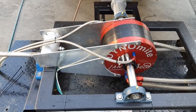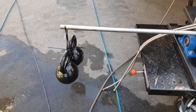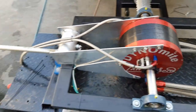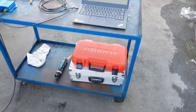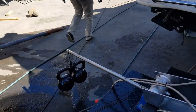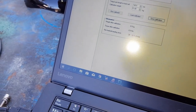We are doing the calibration. We have done a zero calibrate already, and now we have added a long arm and about 51 kilos. The trick with this long arm is that you can tell your dyno that your load cell is here and the arm is all the way over here — a long arm — meaning you can get away with a smaller weight than you otherwise would use. I just pressed load calibrate and as you can see it looks super stable at 51.8 kilos, so we can save the calibration. As a double check, you should always remove the weight again and see that it goes back roughly to zero. So now we've removed the calibration weight and you can see it sits at zero. So we are ready.